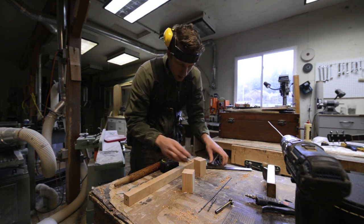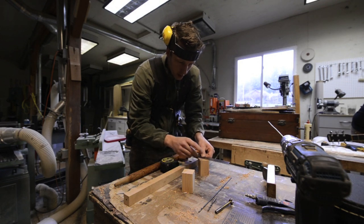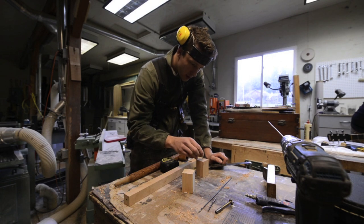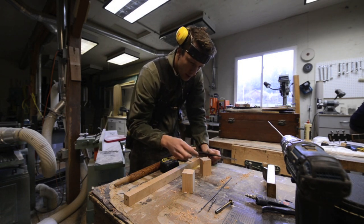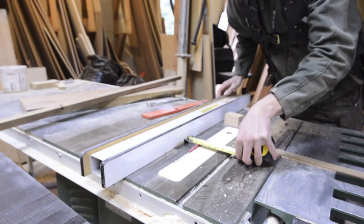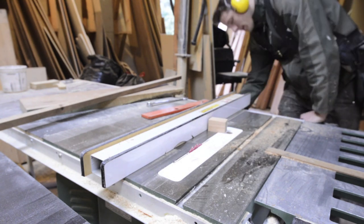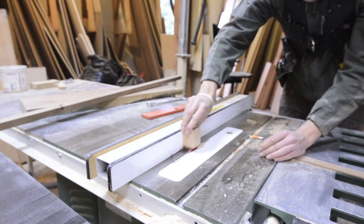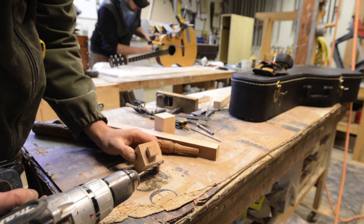That part's going to fit into the hole, and the rest you're going to carve into whatever shape you want. You want to make a center mark on each one. The diameter of your bowl will be one inch, so I use a one-inch diameter forstner bit to drill down. On the other side, draw a five-eighths diameter circle to fit inside your five-eighths hole, then drill about a three-sixteenths center hole through to connect to the tobacco chamber. Set the table saw to two and a quarter to the inside of the blade, maybe half an inch. Once you've got the squares roughed out on the bottom, take a three-sixteenths drill bit.